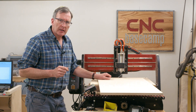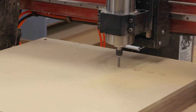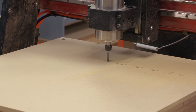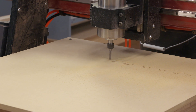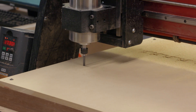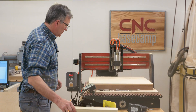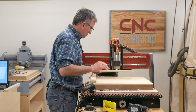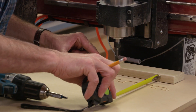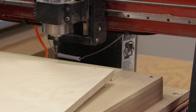What I'm going to do is have my CNC lightly ghost the image of the box joint I'd like cut on the end of my panel, along with ghosting the image of the pins of my box joint. It's also going to ghost the image of a little bit of my side. Once that's done, I can set a fence to register the side of my panel and a fence to register where the pins are to be cut along the length of my part.